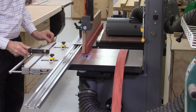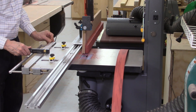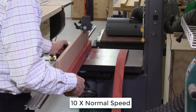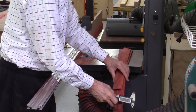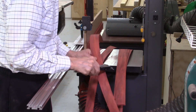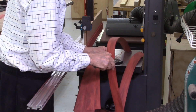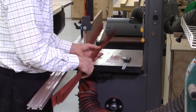One full revolution for the blade kerf, then dial in ten thousandths. I just finished cutting ten boards approximately ten thousandths of an inch thick. Checking the thickness on all ten Red Heart boards with a vernier, the boards all measured between twelve and fourteen thousandths of an inch thick — thirteen thousandths plus or minus one thousandth. This demonstrates not only the accuracy but also the repeatability of slicing boards with the AccuSlice system.